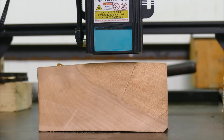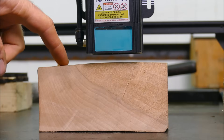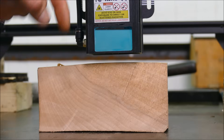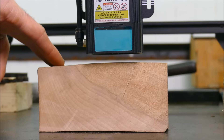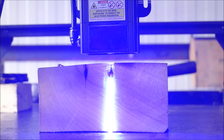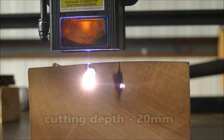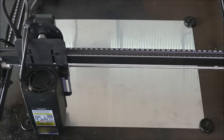Now for the endurance test. I have roughly three inches or 75 millimeters of lime wood, otherwise known as linden wood. Linden is excellent for carving — most people use it for making bowls and spoons. I want to run the laser for an hour straight at 100% and see how deep it will cut through wood at standard height, doing a half-on half-off circle at 200 millimeters per minute. We're about 10 minutes in and already catching on fire, which was kind of expected. I'm going to stop this experiment and start a new one — 5,000 mm/min at 100% power on a 290 by 290 millimeter image that should only take 25 minutes.